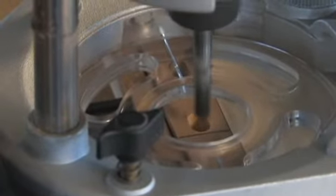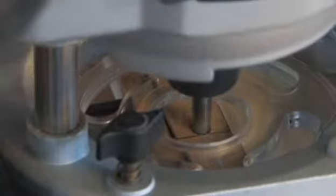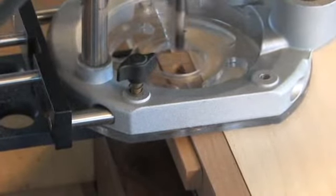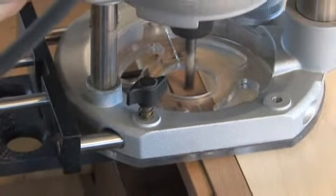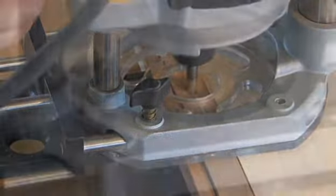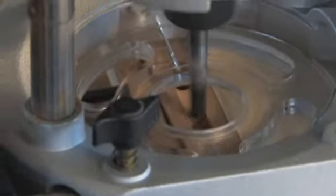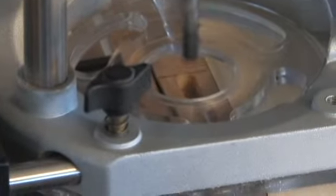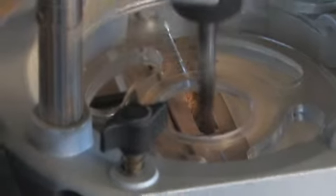And then back up and line up your bit right on the line and make one continuous plunge all the way down to the bottom of the mortise. Repeat this procedure at the other end of the mortise to define the opposite end. Then cut the middle waste that's left over by making pushing cuts with the router. Again, cutting eighth inch deep with each pass.